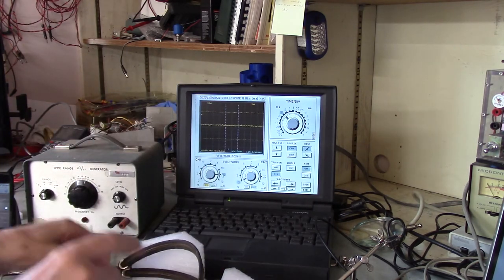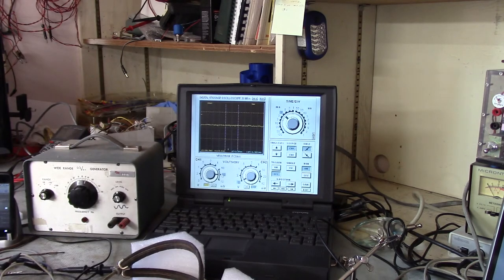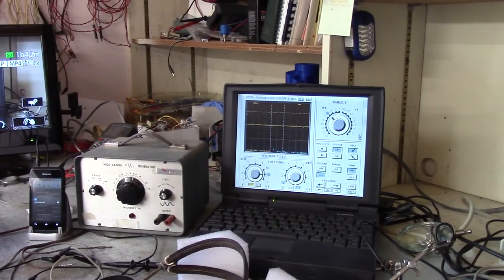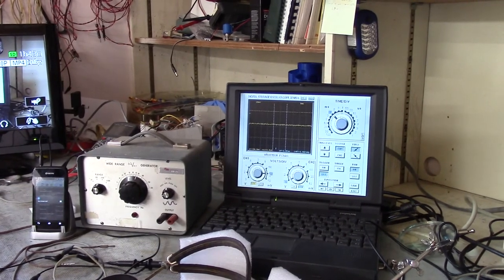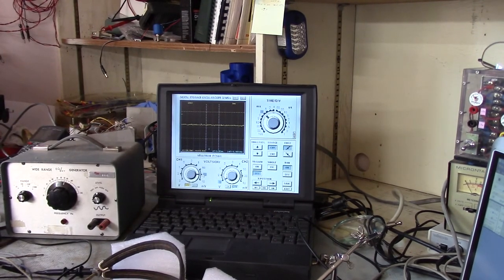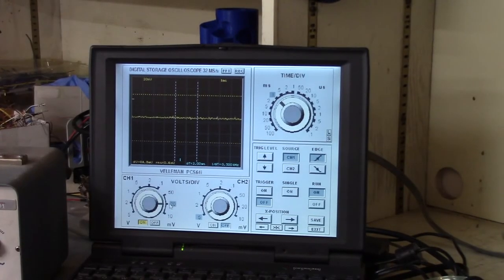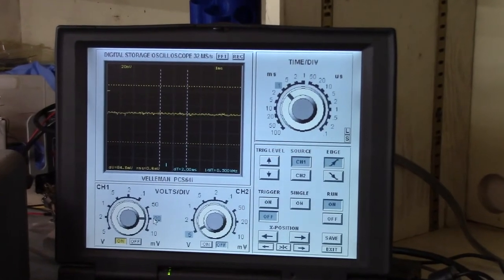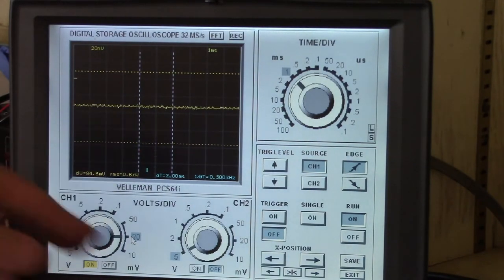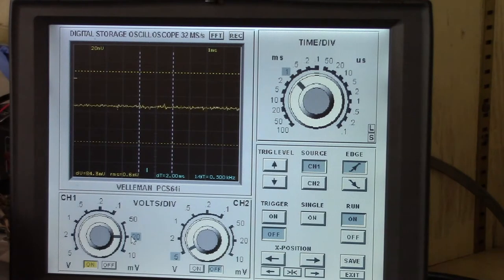At the moment, I just want to look at the electrical load characteristics of these guys. And so what I've done is I've tried to figure out what average signal would work for both headsets and be manageable. So I've got over here a little old cell phone acting as a little MP3 player, and I have it rigged up with some wires, alligator clips, to take the output of what the headset is being fed signal-wise and pipe it into the oscilloscope at a position that seems to be a compromise for both as far as voltages, divisions, and so forth.